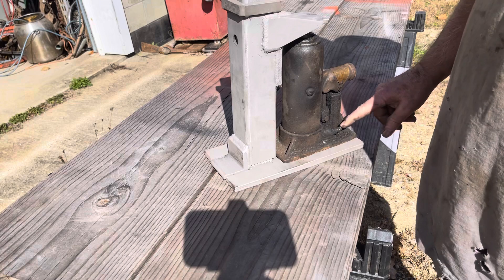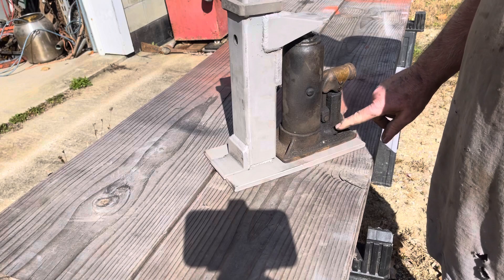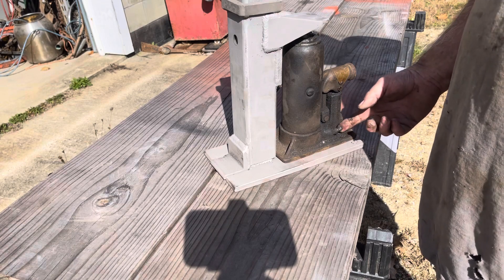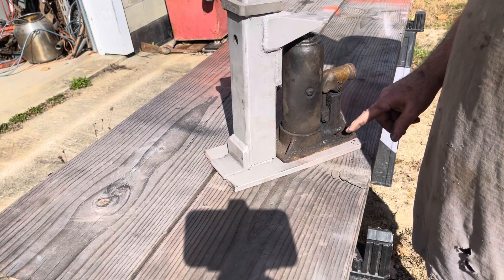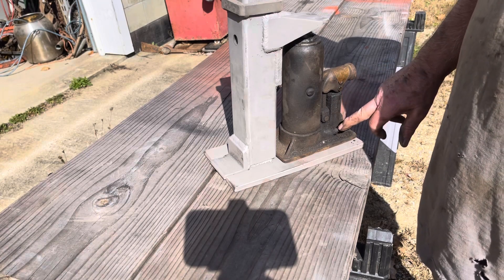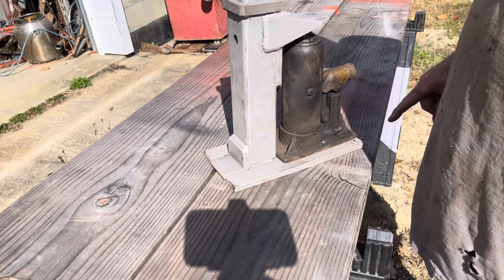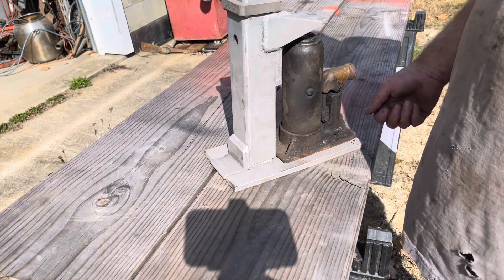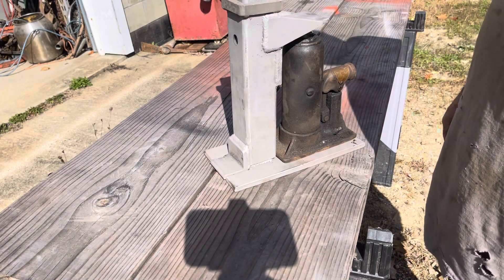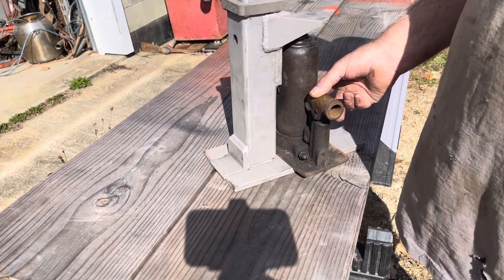I still have to make a knob for that so I can get it out here and turn it with my fingers. Part of this pin is broken off, so I'll have to see if I can drive that out and drive a new one in. My plan is to make a little extension — mill or turn it on the lathe to fit over this with the pin removed — and then cross-pin it so there's a knob you can use with your fingers instead of that stupid thing that comes on the jack handle. I just got it out here in the sun today, hopefully to get a little paint on it.